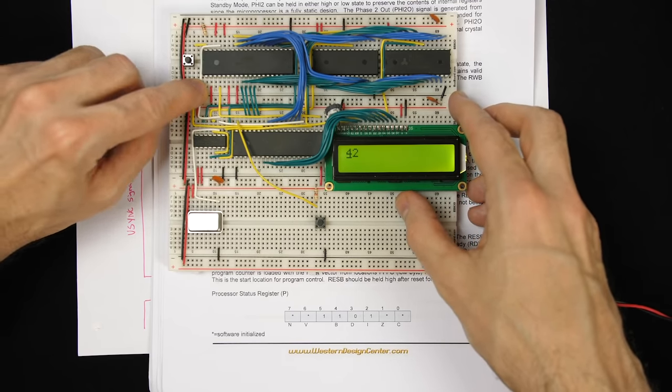Adding these buffers and connecting the buses gives us a way to switch each on or off, and we'll need logic to figure out when the right time to do that is. When the video card is controlling the bus, all 16 address lines are hooked up, so it could talk to RAM, ROM, or even IO. So what addresses do we actually want it talking to? Looking at how it's currently hooked up, the counter lines connect to the address lines of the ROM — 14 address lines counting from 0. We need to map these 14 address bits into the 16-bit computer bus.